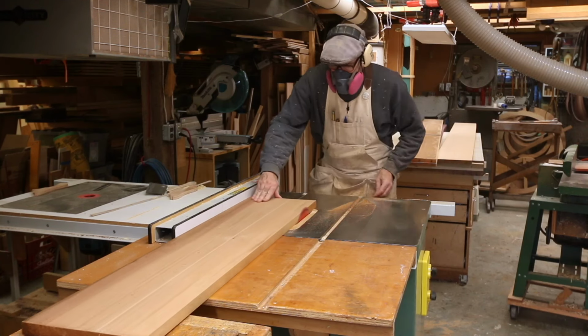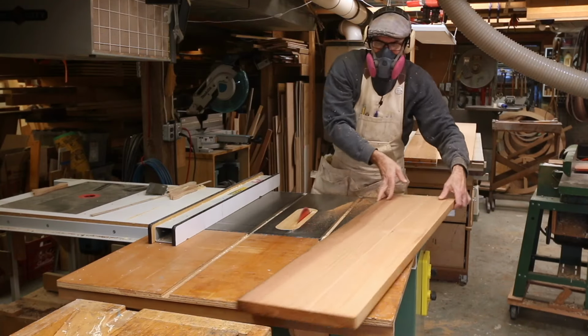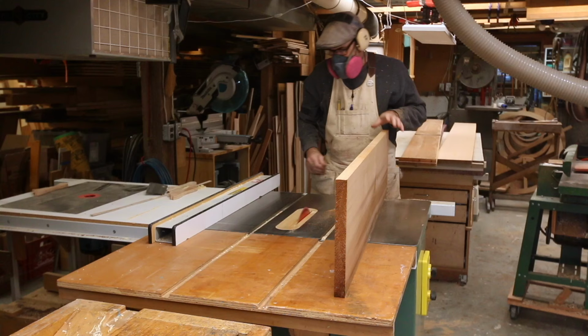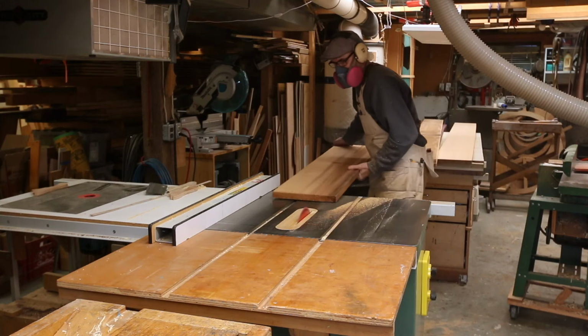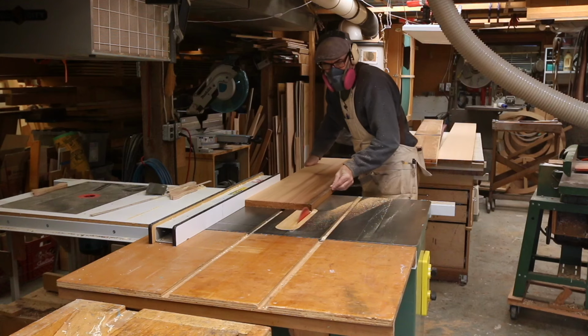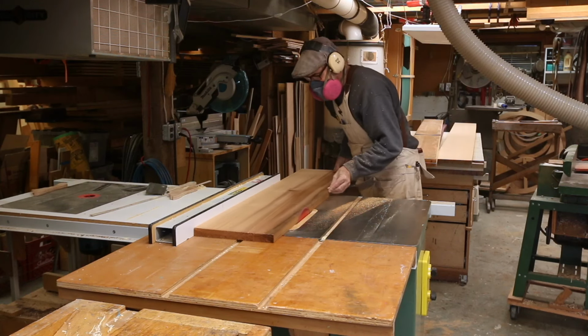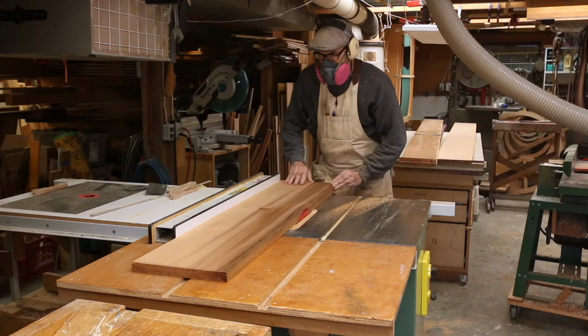Now I realize there's probably some little jigs that you could apply to your table saw fence that would allow it to mimic the action of a jointer. But honestly, it's not worth the fuss of trying to set that stuff up. Just a couple of rips and flips, and I'm usually close enough to where I need to be. I like to keep it simple this way.